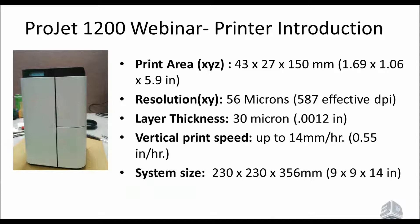Now we're going to cover the new software for running the new materials. The new software is called Geomagic Print version 1.2. It's the same as 1.1 — same features, same layout, same controls — with a couple of new features. The first new feature is the ability to select new materials. You click the PR button in the top left of the screen and then select materials. You'll see the six available materials, along with some placeholders for potential future materials — ignore those for now.